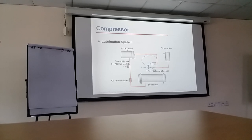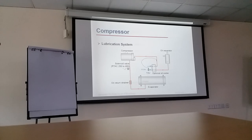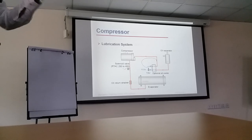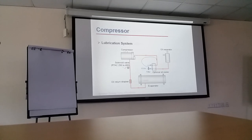They are not giving it in units that have only a single compressor — those don't have the solenoid. So if you are facing the issue, you have to go through with the field installation. You can do it yourself, you have to install and modify it. If you have a maintenance contract there, it will prevent any further failures and you can give them a preventive action.